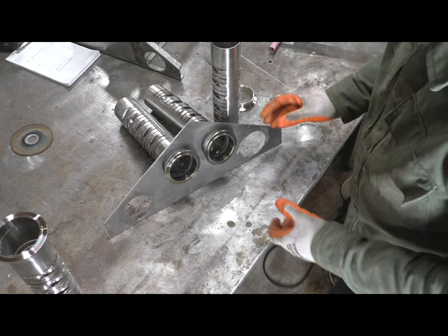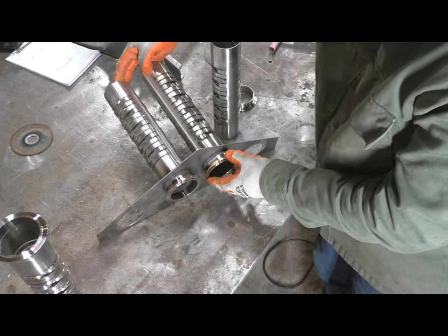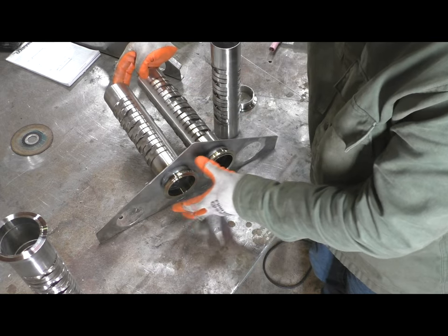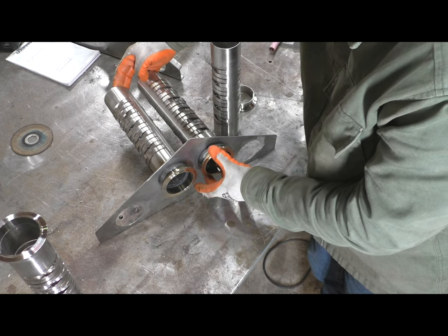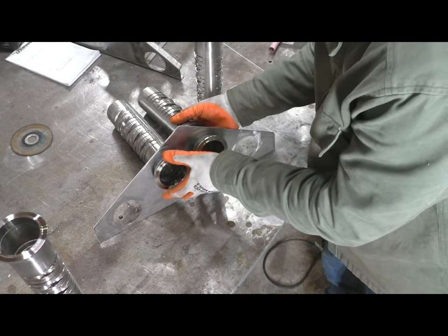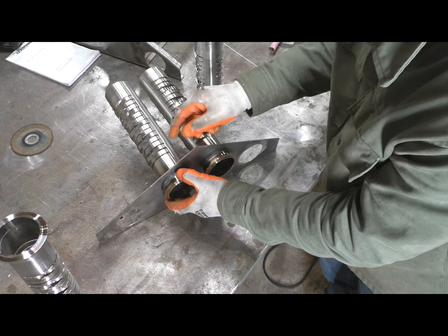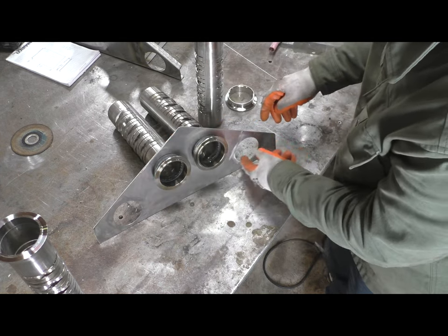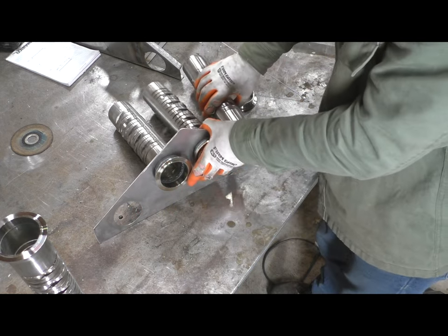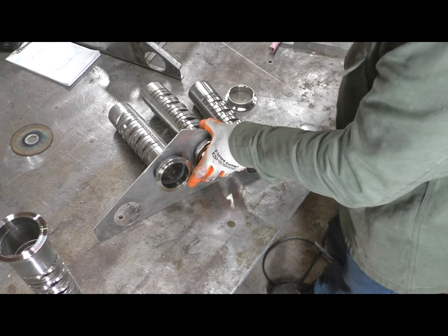Getting ready to finish up welding the baffles in place here, the through tubes, and you can see how they're going to go in place in the entrance part of the exhaust, and then they'll loop around in here and then come back out. One of the issues that's challenging here is as soon as I put any type of profile or bends in these, they no longer pass cleanly through these holes, so I have to weld them in place. Which is not that easy because you're not welding at a comfortable angle for putting a flange on, but it's really the only option.